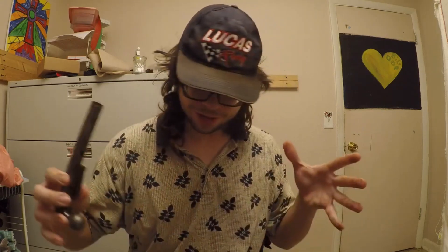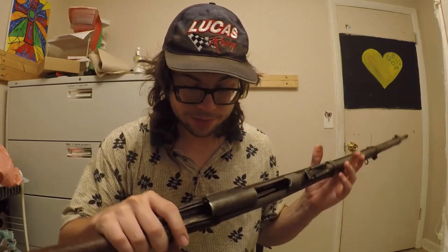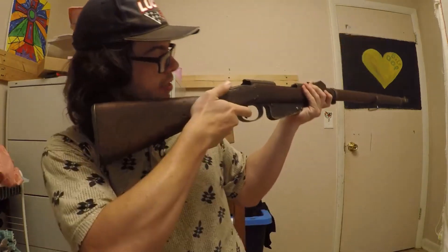I actually have more than one of these rifles, and I'm expecting some to basically just be wall hangers. This one right here might just be a wall hanger between the broken stock and the busted-up bolt — I don't foresee bringing this one out to the range. This is chambered in 8x50, so the ammunition is basically not obtainable anyway. On the side of our receiver, this is our bolt retention system. Looks like we're missing our spring on the side — that's likely why the bolt came out. The sear seems to work when I pull the trigger.